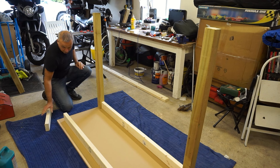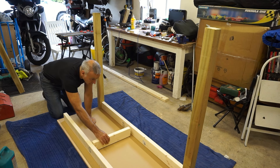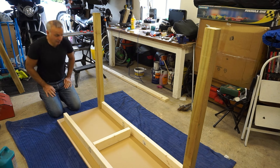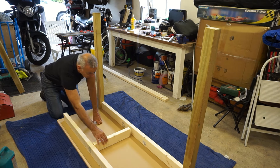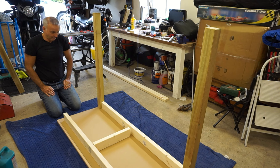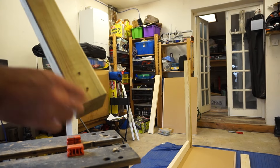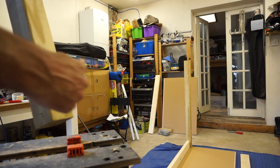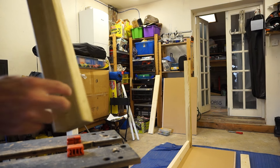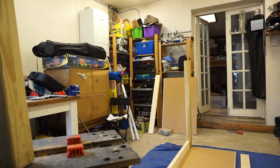After it's constructed I'm going to get some more timber pieces - slightly longer ones - and put probably at least one in between the legs in the middle to add a little bit of further support, although frankly I don't think it's really necessary. On every leg I'm going to do two holes for the length and then one in the middle, so the screws going through there won't interfere with each other. That's my prep - let's do that on all the legs and then screw it together.